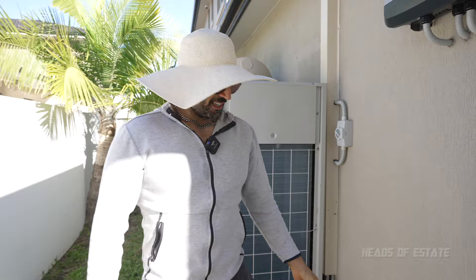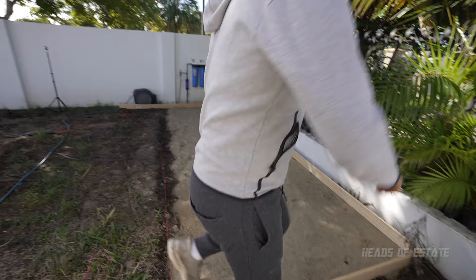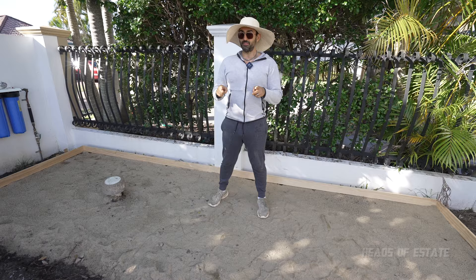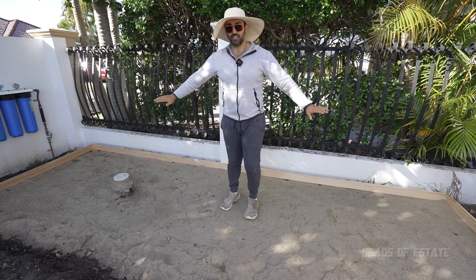Let's go back over here and figure out what we're doing. I've got a bunch of pine pieces of wood and I've stuck them around this edge. What I've worked out is the gradient fall of the land — if you look at the wall very carefully, it's a slight slope going in this direction. The problem with slabs for sheds is it needs to be perfectly straight. We're not doing a concrete pad, just tiles, but the idea is you have to keep this straight, so we're making this 100% level.